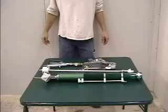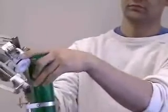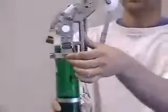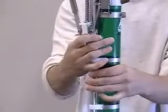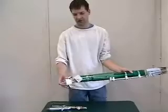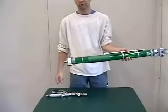The CFS tape applicator is comprised of a valve end, a taping tube with its component parts, the internal CFS taping tube, and the taping head. To assemble, line up the small groove in the taping tube with the corresponding nipple on the taper head and clamp down the SS latches. Attach the arm mechanism and screw down tight. Next, slide the CFS tube into the green taping tube and clamp down the SS latches. Your CFS taper is now assembled.